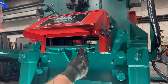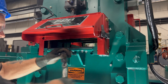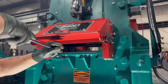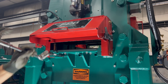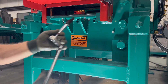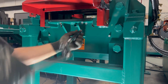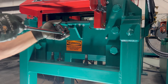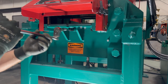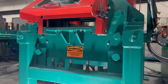We're going to take off the front shear blade, which would be the bottom shear blade, first. You want to loosen up all three bolts, then I usually take out the end two and leave the bottom one in until I get them out. Set the bolts down somewhere nice and easy to get to when you're putting everything back in. That's all you need to do from this side.